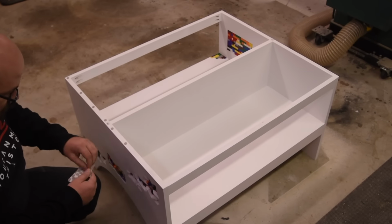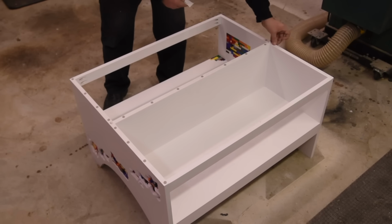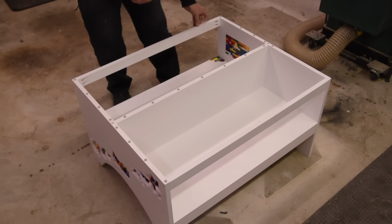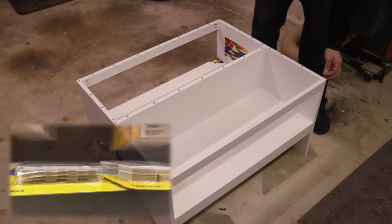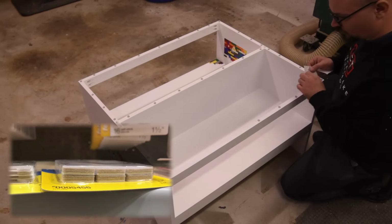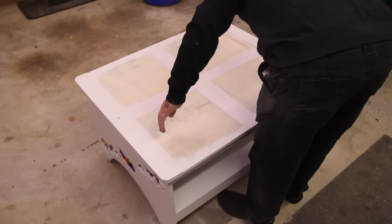Since the top will be flippable, I don't want the base to mar the top, so I put a bunch of tiny felt pads on the top of the base. Now I opted out of using the wider pads because they were twice as thick as these small ones, and they would have interfered with the dowel and hole mating system I used.